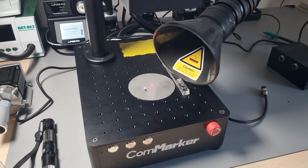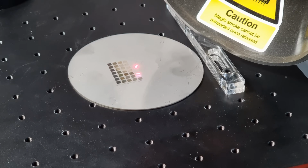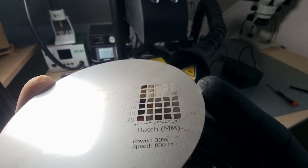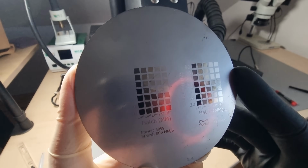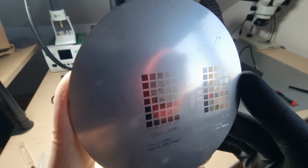Stainless and titanium are very interesting victims to fiber lasers, because by dispensing just the right amount of energy into a surface, you can make it grow a thin oxide layer, which can give a workpiece interesting permanent color effects entirely without additional chemical dyes. MOPA fiber lasers like that SPI unit we've taken apart once are especially nicely suited for this, because they give you maximum control over the impulse timing. But it works with Q-switched models too if you do it carefully.